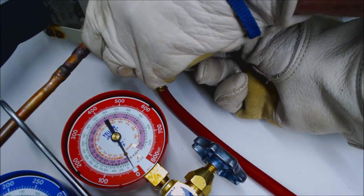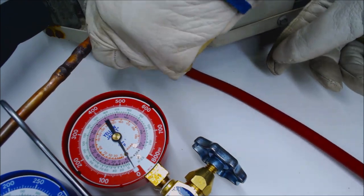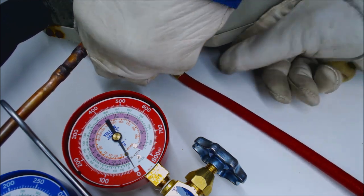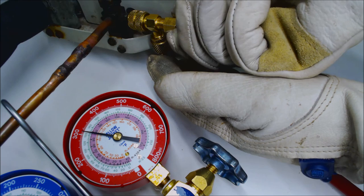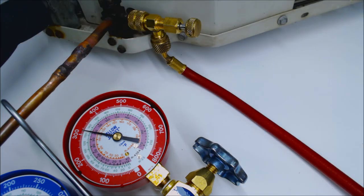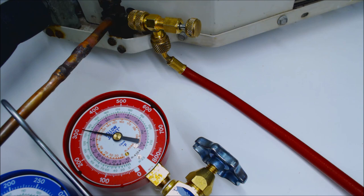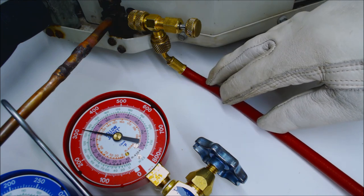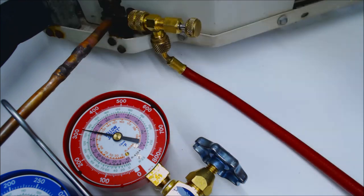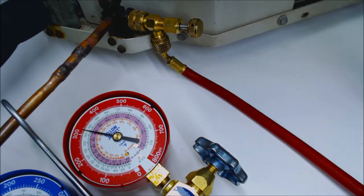There's no rush when attaching this on because it's not pressing in on the valve core yet. Once you turn it in — again no rush — we're now reading right around 315 psig. When disconnecting the liquid line, you trap the refrigerant in the high-side hose and weigh it back into the vapor side. Make sure you've already purged the air out of the refrigerant hoses first. Then just back seat this and disconnect.